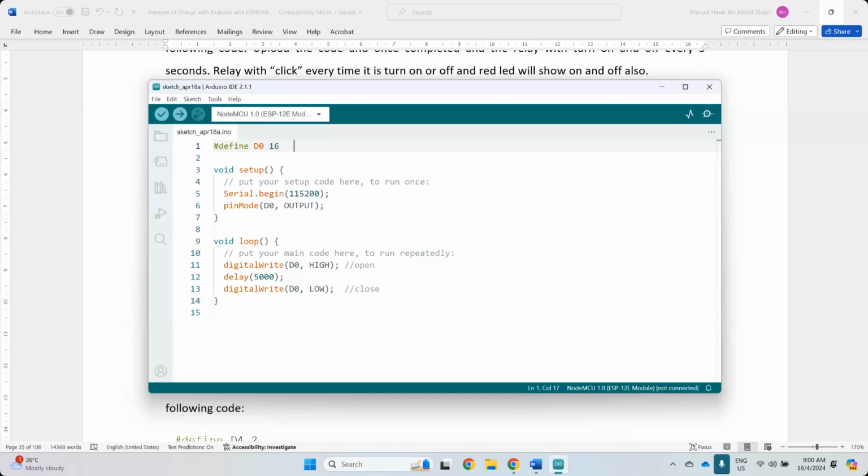Most sensors can run at like 50 milliampere, 100 milliampere. But when you total them up, do not exceed 200. 200 is already much. You're already pushing your microcontroller. Your microcontroller will get hot if you try to draw too much amperage from it.